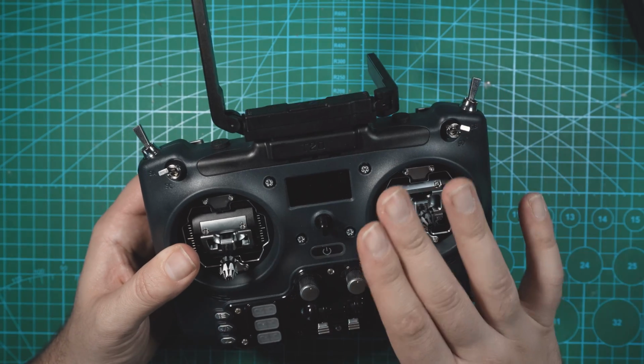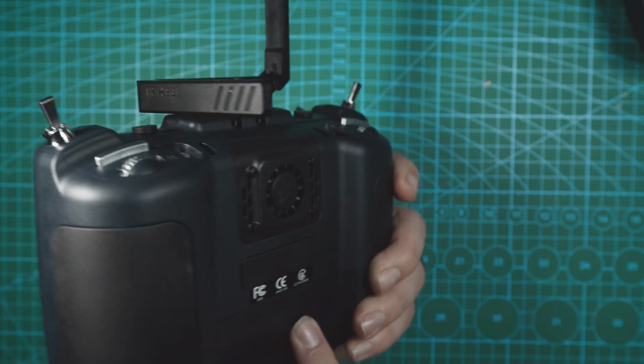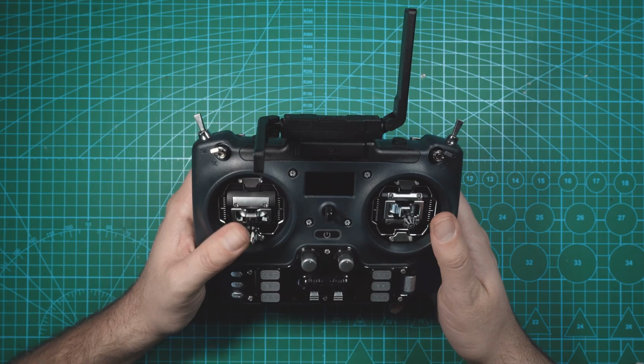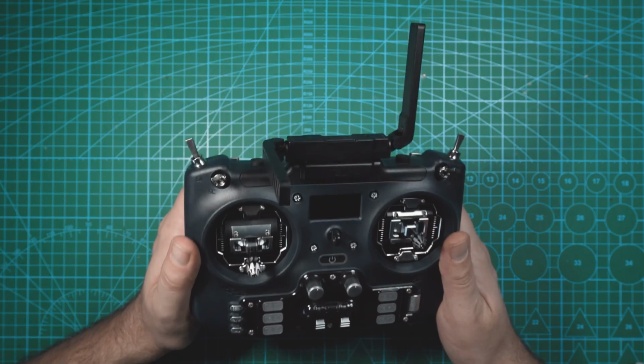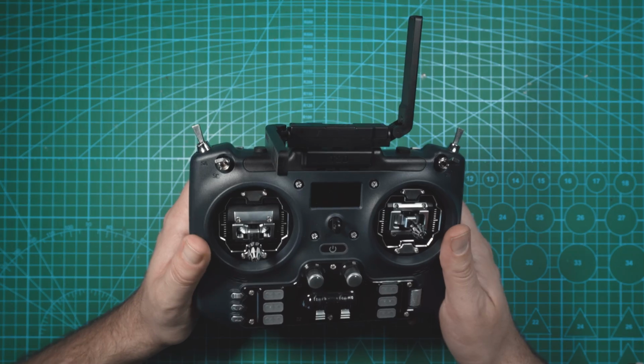Keep in mind that if you are using Gemini, you are going to be powering 2 transmitters in this thing, so it is going to drain your battery a little bit faster. So the Gemini T20 I think would be good for anyone that's flying mainly in areas with high RF noise or congested areas where you've experienced micro failsafes at close range.